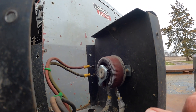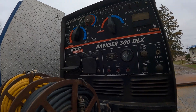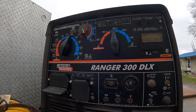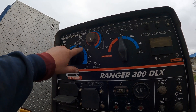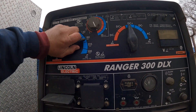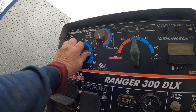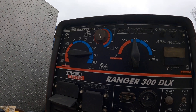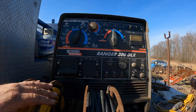When I first started in the trades, they told me to keep it on that flat spot where it can take more amperage and won't possibly burn out one of those little coils. That's why in my previous videos I talked about keeping it on high when carbon arcing. My machine is like in between an older machine and a digital, controlled by gear selectors for the coarse settings — I'll run it at 180 amps or up to 225 and leave it at 100% or max.